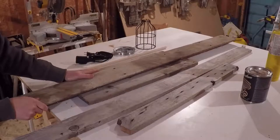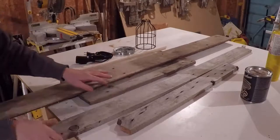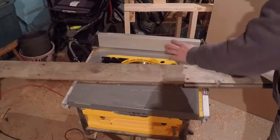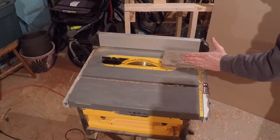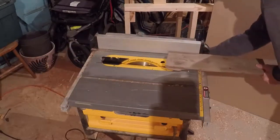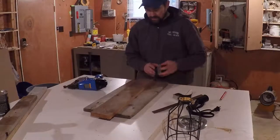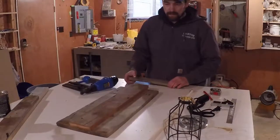Something a little bit different, but I gotta put this to the skill saw to cut the edges — we start trimming up the edges like this, straighten this out first and go from there. All I'm doing is just setting up the guard just a little bit skinnier than the width, just to get the edges straight. That's the whole idea here — save as much board as we can. Now I'm just gonna center it with the board.